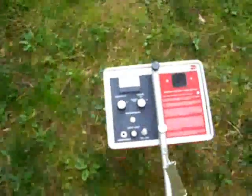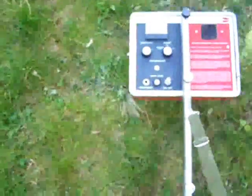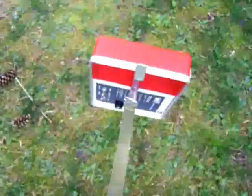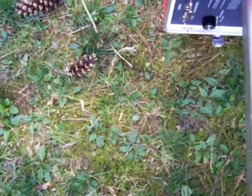You use this for blind searches. If I didn't know where the cable was, I'd just keep walking. What I do is walk and wait for that meter to peak. And you see it right there — it just peaked. I just walked over the cable. And where this peaks is right over the transmitter on the rear here. That is peaking right where that cable is.